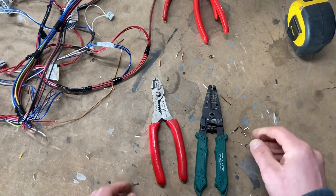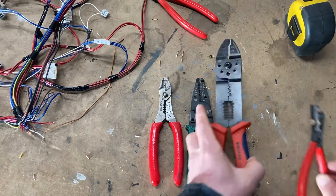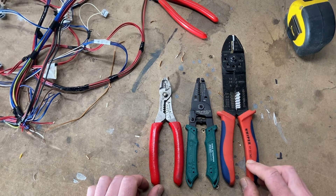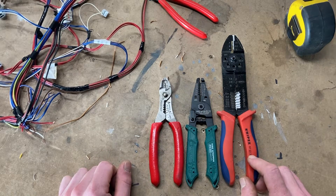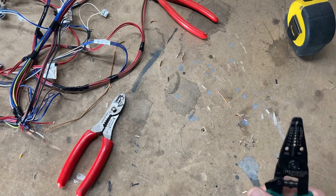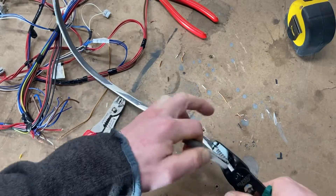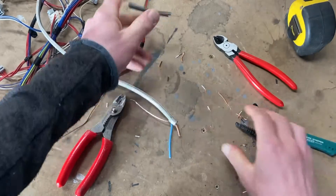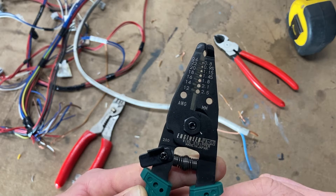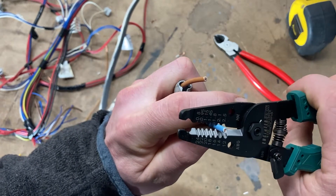Here for comparison you've probably seen a set of wire strippers like this — pretty similar in size, a bit smaller. This set of strippers, slash crimpers, slash cutters is surprisingly good — the strippers are nearly the best I've used to date, very precise. But let's look at the Engineers. Testing the cutters on 2.5mm² wire — that's around 14AWG — so I'd need to use the 2.1mm diameter hole for this solid core conductor.